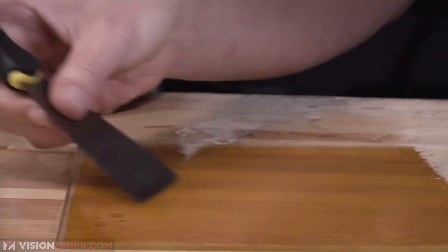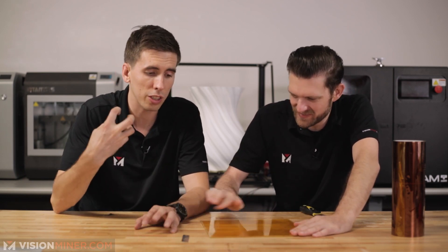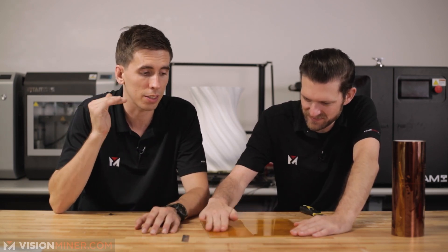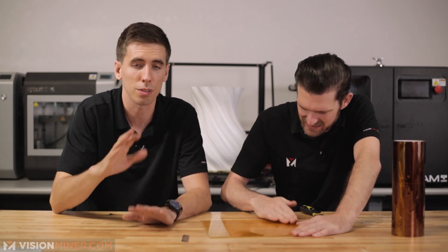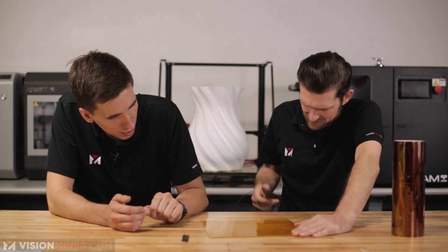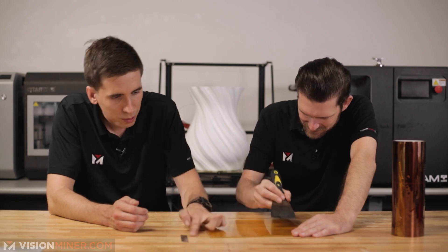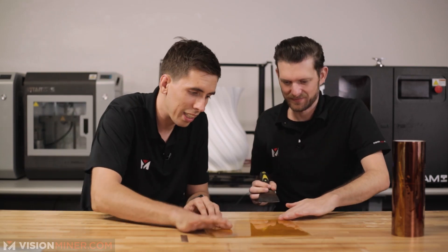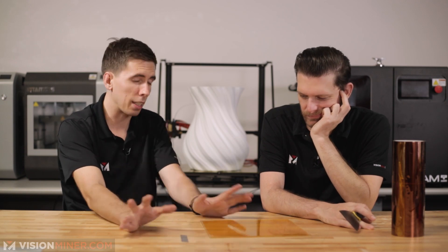It's worth it. This will save a $40 to $80 glass plate — you won't have to replace it. This keeps it from chipping, pulling chunks out, or cracking. It's really good if you're printing ABS, which is so strong. Use Kapton or something else like any kind of bed coating for ABS. You'll usually notice there are still little bubbles and bumps, and sometimes a piece of dust will get stuck in there, but most of the time it's not enough to ruin your print.